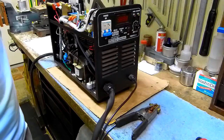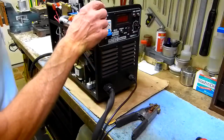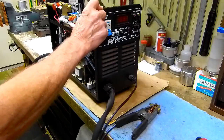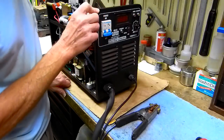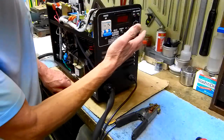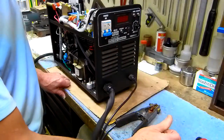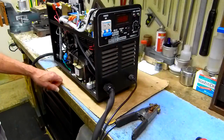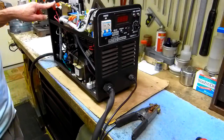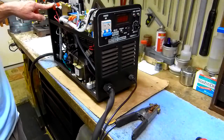I set it up on the workbench and didn't even think about putting air to it — I just connected it to power. It wouldn't even do what he described: the lights would come on but the ammeter wouldn't work. I eventually found out that these units absolutely must have air pressure on them. This here is an air pressure switch.